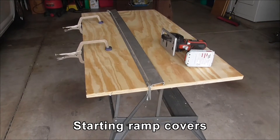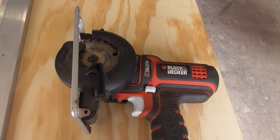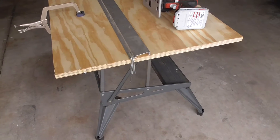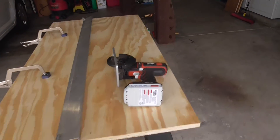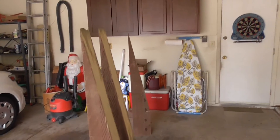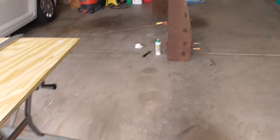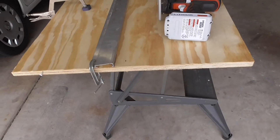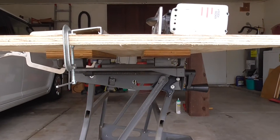This piece of plywood is 4x2 foot — I'm going to cut it right down the middle. I'm using my drill saw, a very handy saw attachment on this Black and Decker. It's just deep enough to cut this 3/4 inch ply, which is going to be the main ramp surface on the ramps I've got set over here gluing and drying and screwed. I've got the offset cranked in — it needs to be 27mm for that particular guide. Most importantly, I've made sure it's not going to cut my workmate in half, and I've got the left side clamped so it shouldn't move.